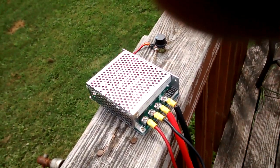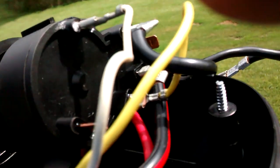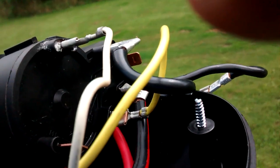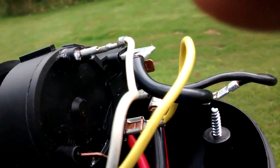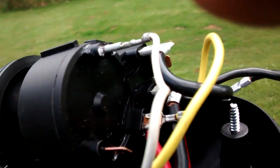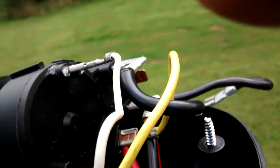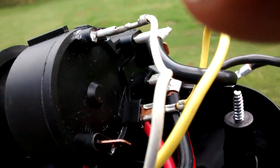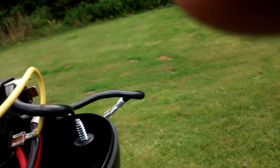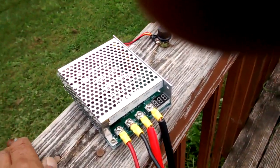I got it hooked up. At the top you have power coming in — two wires, hot and negative — and then black and red going down the tube to the motor, which are the hot and negative that go to the brushes. There's also a yellow and white wire that hook up to the built-in potentiometer in the prop housing behind the brushes, epoxied in there to keep it waterproof. Those two wires are just for speed control. I deleted those and went straight with the black and red wire coming up from the tube — I won't need the yellow or white anymore because this speed controller handles that job.